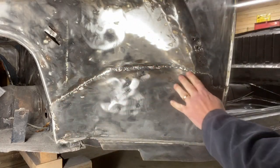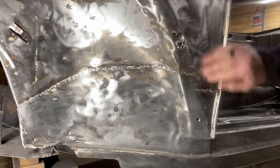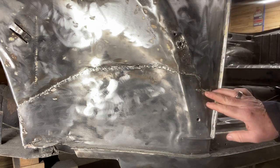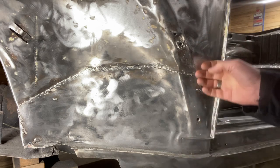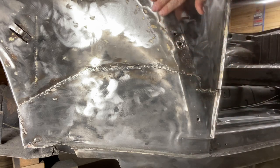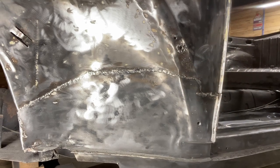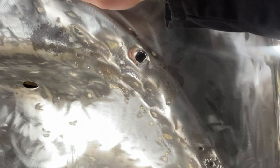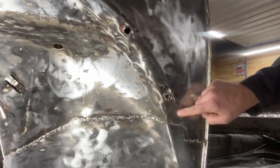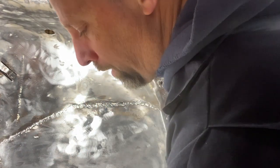Here's my project for tonight — it's this joint right here, particularly out here where it gets into the front quarter panel of the car. We can do better than that, particularly not wanting it all covered in Bondo. Eventually we need to look at this bevel, the shape of this, to make sure it matches the fender. We'll also have to weld in repair nuts for the fender attachment points. But tonight we're going to start with this seam right here. This is a lap joint.